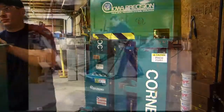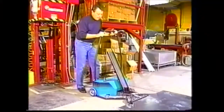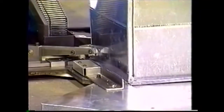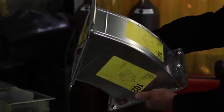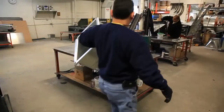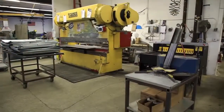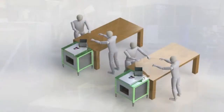15 years ago, the Lockformer Company introduced the Corner Cadet for field use and for contractors needing a more flexible shop floor assembly. It is portable. Today, fabrication of smaller and smaller TDC, TDF flanged ductwork is being market driven, and most Corner Cadets have been mounted at bench height or with other modifications for fitting use only. This contractor put a Corner Cadet at each bench. A better design would be a new corner machine specifically designed for fittings that 2 workers can access as needed.